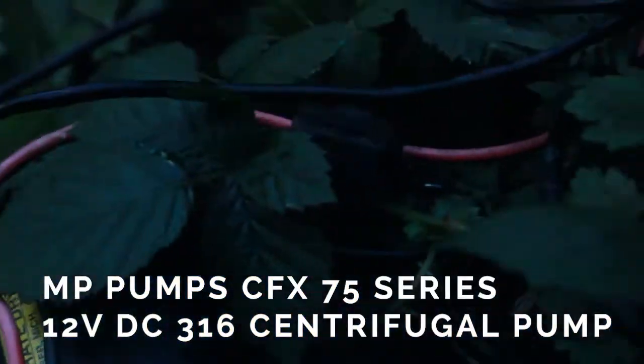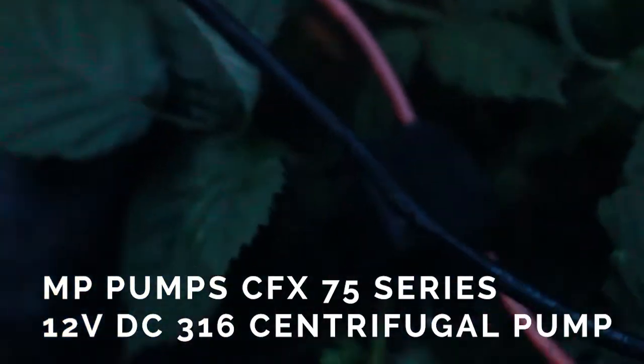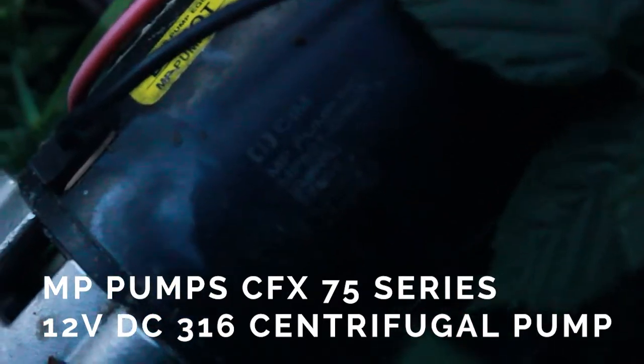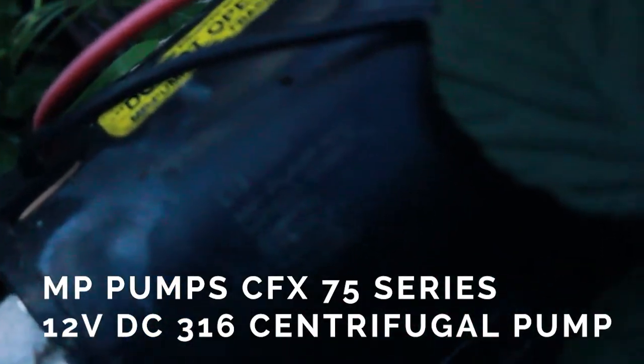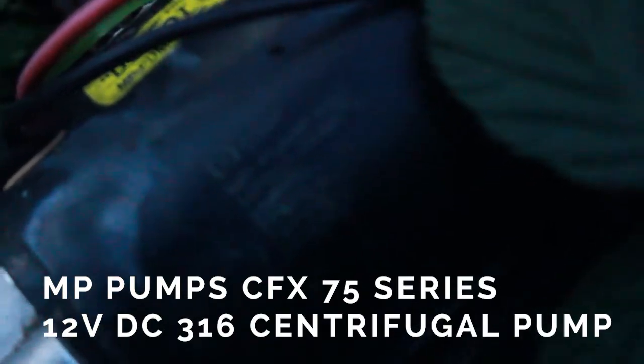Okay, so all we have coming from the pump is a positive and a negative terminal. And these are just like jumper cables. Makes it really easy. You don't have to disconnect any sort of bolts and put them back on. Those ports are connected directly to this pump, okay? And this is a pump made by MP Pump Inc. There is the sticker right there. Okay, so there is the pump. There's the model number. It's a 12-volt pump. This whole system is operating off of 12 volts.